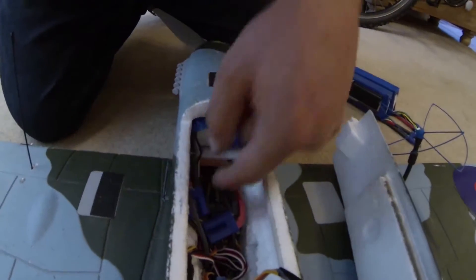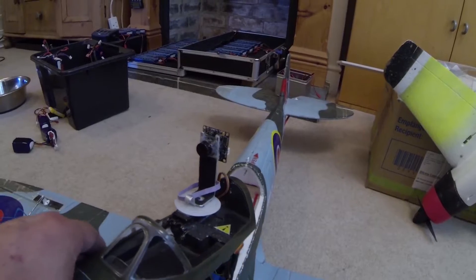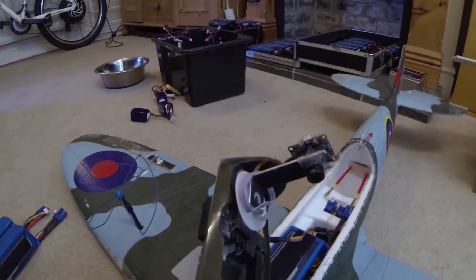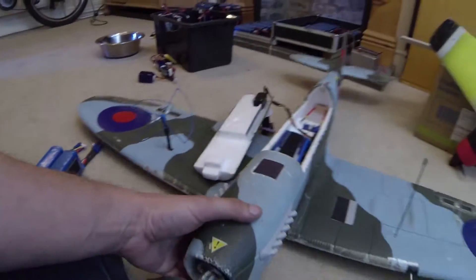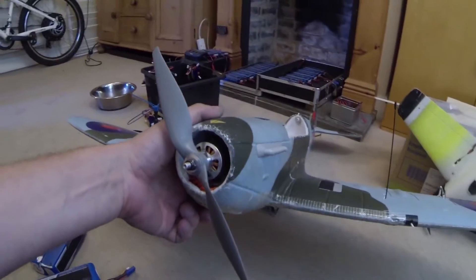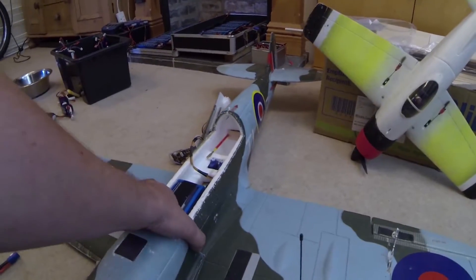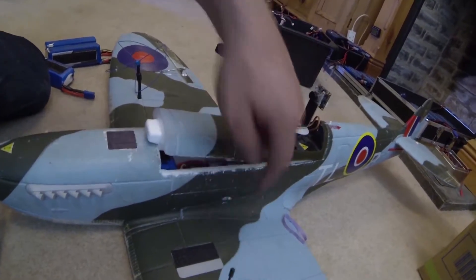There's one in there already, so yeah, that's where it goes. The camera arrangement is a standard Sony HS177 and the GoPro sits in that cradle underneath it. The servo for the pan is under there — that's a GWS 360-degree servo. The motor in front, which only just fits, is an SK-3 800kV motor, and underneath there is a 60-amp Hobbyking Plush ESC. Everything is as far forward as it can go, including the ESC which is tucked right under the motor. The CG was really hard to get right — with the battery in, without the GoPro, it's kind of about a third of the way along the chord of the wing.